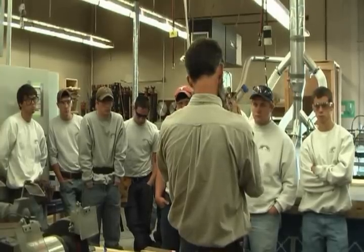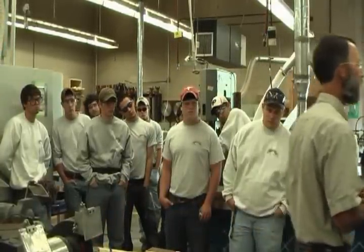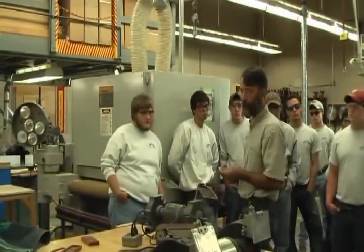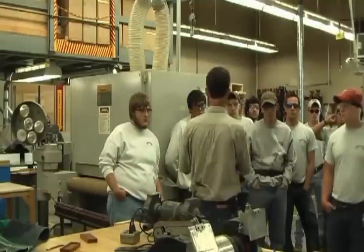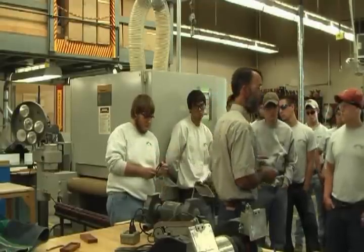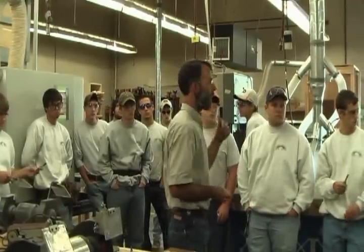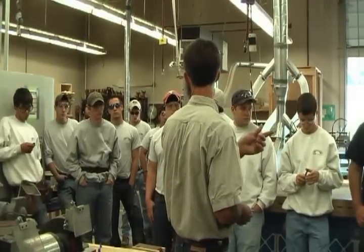I have a hollow grind, just a tiny bit of hollow grind to it. When the new ones come in, they don't want them to rust, so I'm handing you a new one. That one, a carpenter. This one, you can see the stoning that I've done to it. They paint those with some type of a lacquer to keep them from rusting. So if you're going to sharpen it, first thing you've got to do is get through all that lacquer.